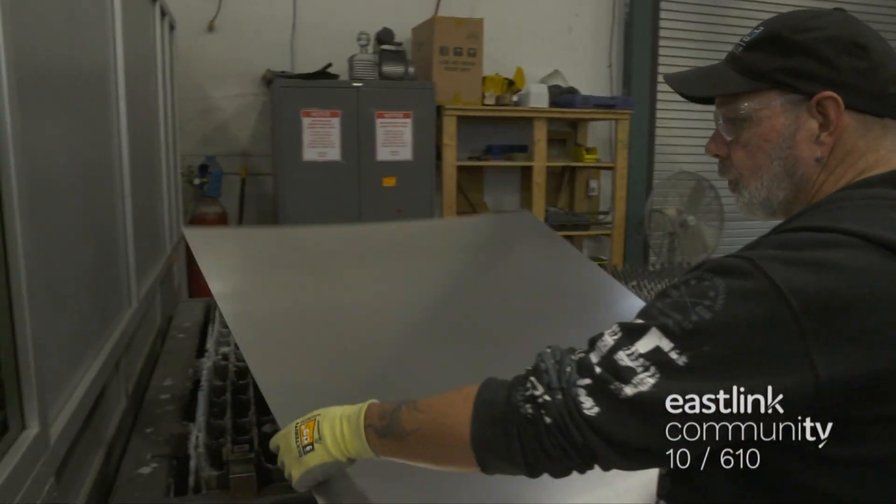Once all of the processes are complete, the assembly and packaging team will assemble the enclosure according to the build sheets. First, the plugs are removed, and the back of the panel is set and screwed in place. The top of the enclosure is set in place, then screwed together with a hand drill. Nuts are added to the front panel, and the enclosure is ready for packing and shipping.